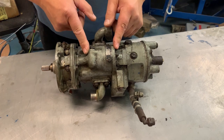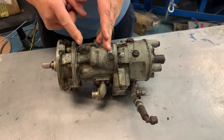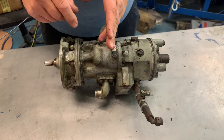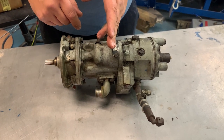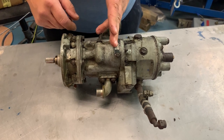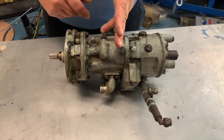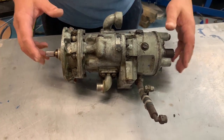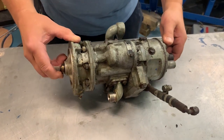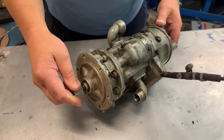Inside this portion, there's a little piston that floats up and down, fighting a constant battle between delivery pressure and servo pressure. Servo pressure makes the engine want to go faster; delivery pressure makes the engine want to go slower. Depending on who's winning that fight with the little piston determines how fast the engine is running. So that's the basics of the fuel pump. We'll get a look inside next and show you the rotor and the pistons.